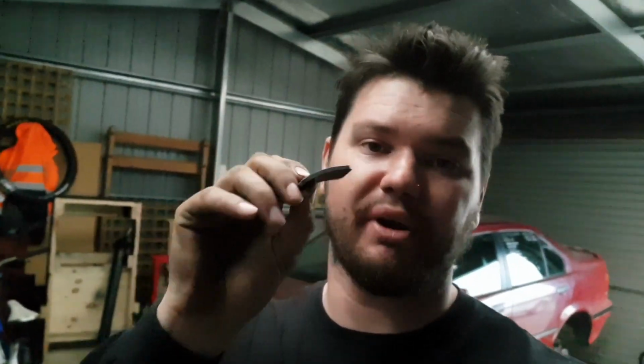I'm pretty happy just to run it if I had to, but for the sake of this video, and because I'm a little OCD and like things being done my way, I went ahead and bent up a couple of plates for inside the diff. I think these are 40mm by 28mm by 4mm thick, and you can see I put a slight curve into them just to contour with the same shape as the gears.